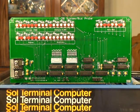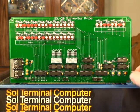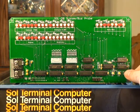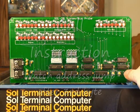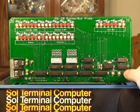The first data byte in the system is CD, followed by 3A, followed by C3. Now it's going to do the call to the next address, and you'll see the address change quite a bit. Then we can single step through the rest of the routine. There are a lot of calls involved here, so the address hops around, but if you follow it in the Solos code, you'll see that everything is absolutely correct here.